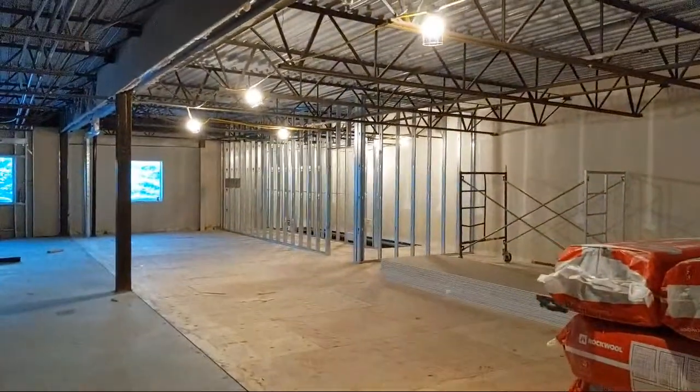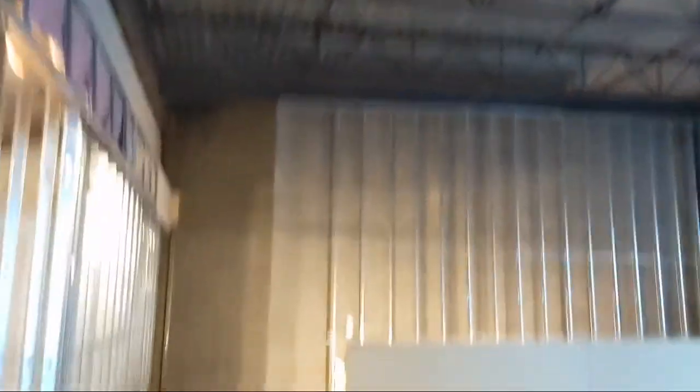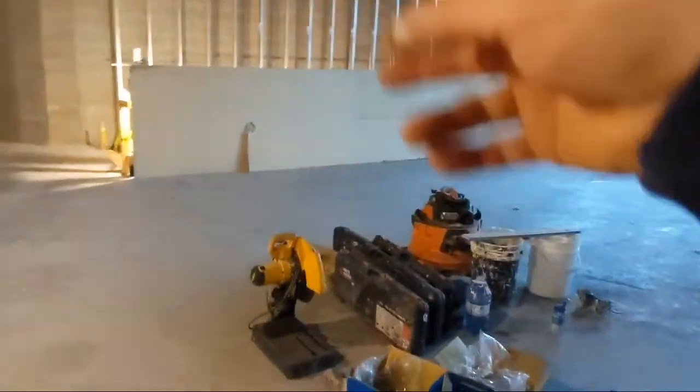This is the upstairs. We built that vestibule in there and stairwell. This is the elevator — a future possible elevator. I figured out this is 17 feet high in here, so I need 18-foot studs, and we had to order those today. You can see at the top it slopes upwards. So basically when I'm doing my ordering, I calculate the footage — say it's 45 feet long, I order 45 studs, then I need five pieces of top track and five pieces of bottom track. But you've got to take into consideration windows and doors — add two studs for every window and door and a piece of track.